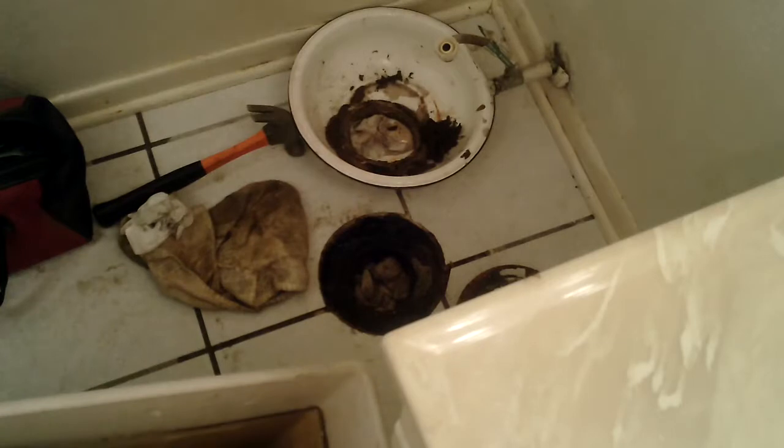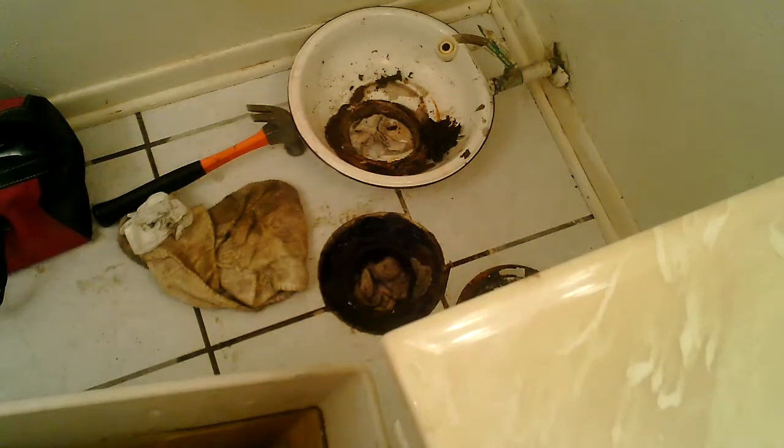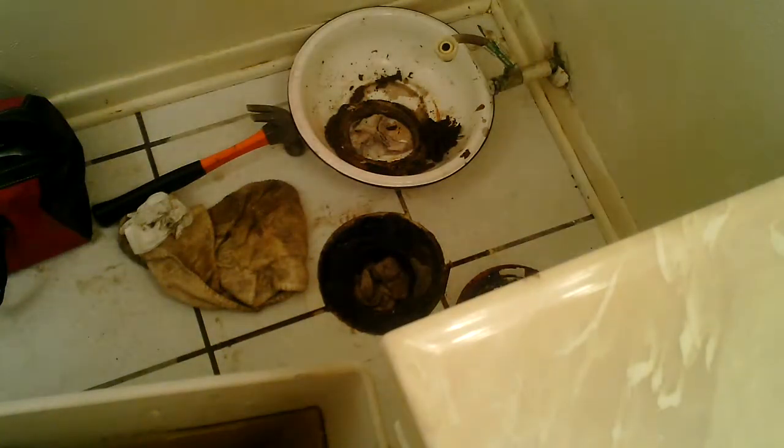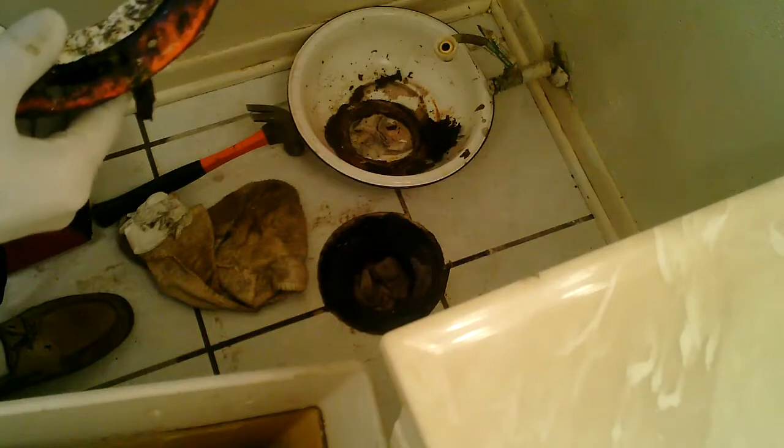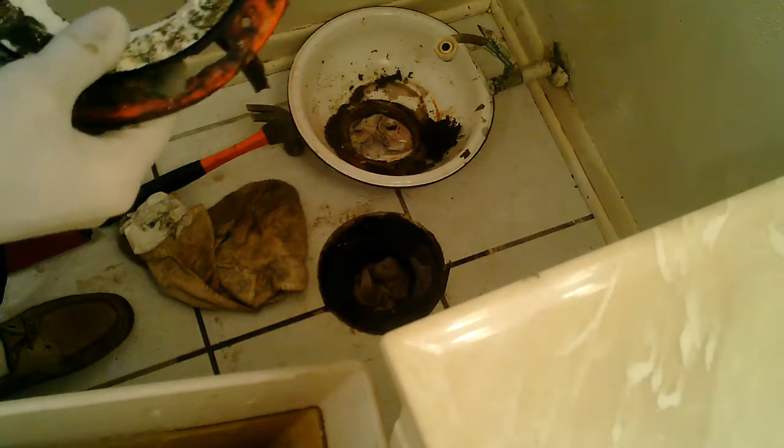Alright, several months ago we put a new toilet bowl gasket, wax, and flange on this toilet. I struggled tremendously getting the bolts lined up without slipping loose because the flange here had been turning inside. So when you slide the bolts down the slots, they simply turned it. And each time you tightened them, the bolt came back out through the insertion slot.